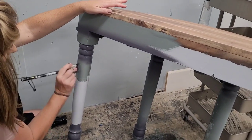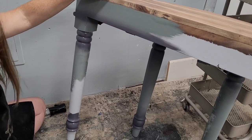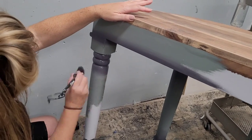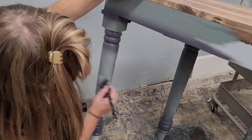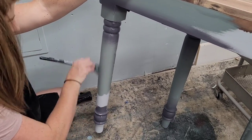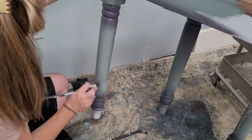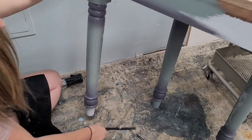This is a great finish to start with if you're just learning to blend with paint — choose two colors slightly different in shade and practice blending. I wouldn't necessarily recommend starting over spindles, as blending over spindles can be a challenge. I just use a horizontal brush stroke, sort of slapping at the leg, wrap around, and make sure my blend matches all the way around. Practicing with a two-color blend really gives you a feel for the paint and how they work together.